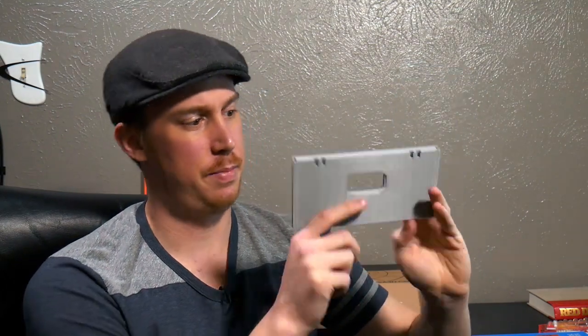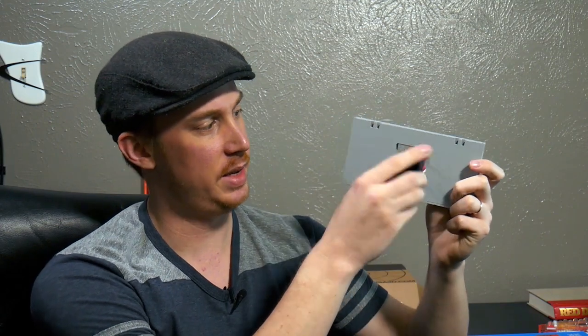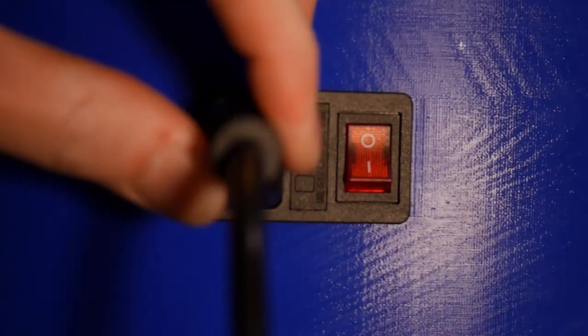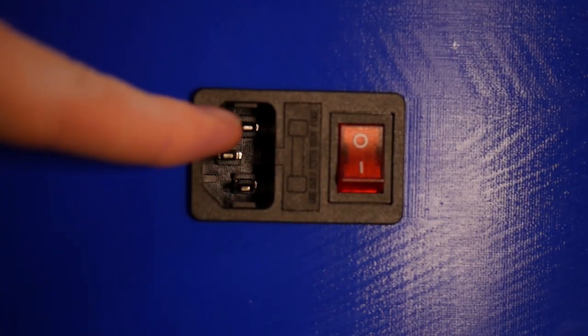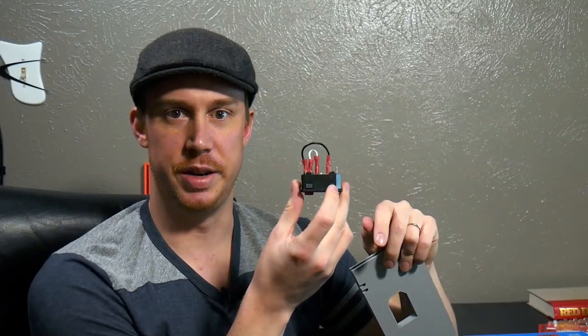There were a few parts that I tested as I printed. For instance, with my first finished parts I wanted to ensure that when I went from small scale to larger scale, it still slid. I also tested this back plate that has the hole cut out for my power switch and fuse. I ended up having to redesign this twice. The first time, there was not enough clearance for the piece to fit in at all. And the second time, I didn't realize I was going to need to design a lip for these, otherwise the power cord would be interrupted by the tab being pushed in.